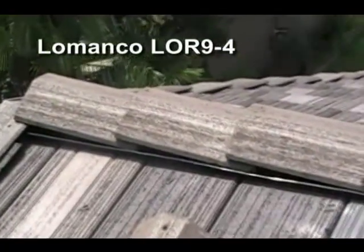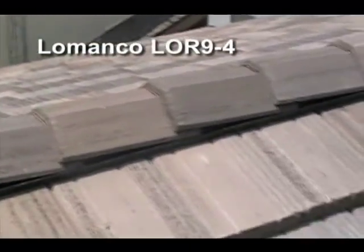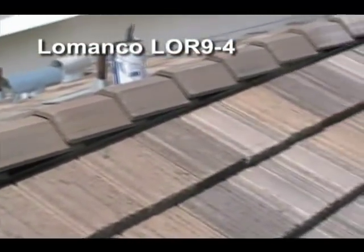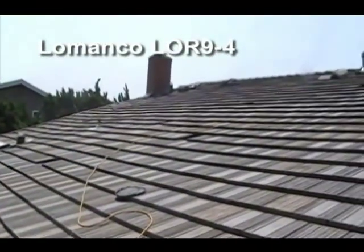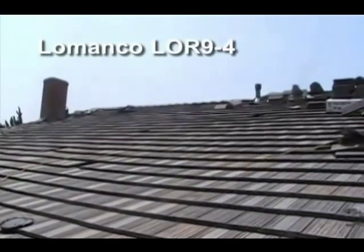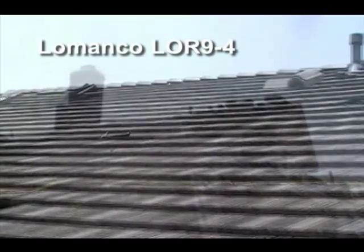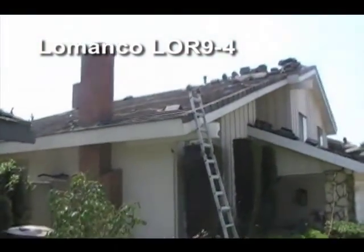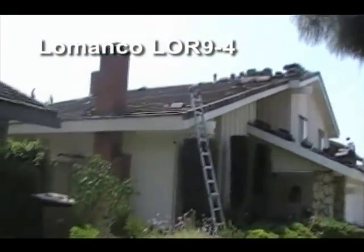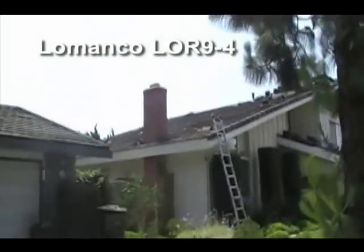the complete product. As you can see, very clean, aesthetically pleasing, and effective. It's the whole ridge right here. No dormer vents, just the beautiful looking LOR9-4 with some beautiful looking tile at the ridge doing the venting. Virtually impossible to see unless you have a trained eye, which, even with that, it's difficult to notice. You don't see it at all from the street view.